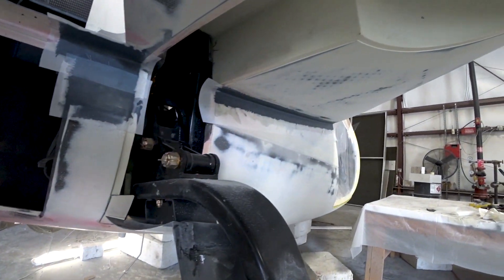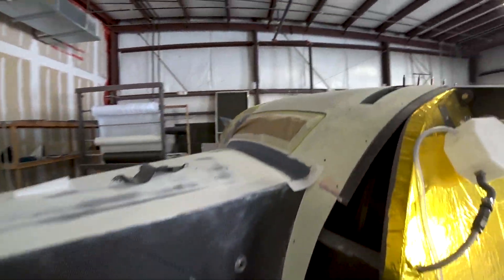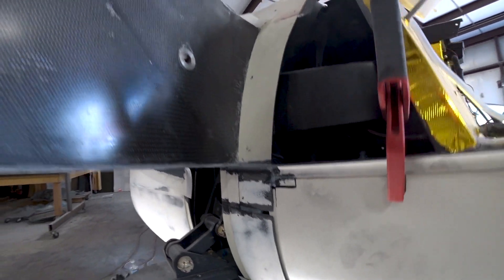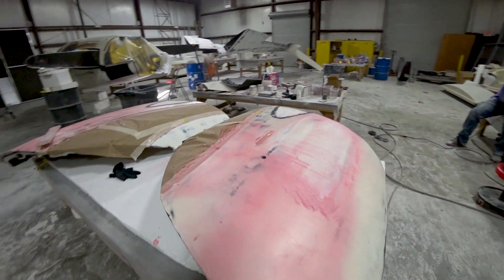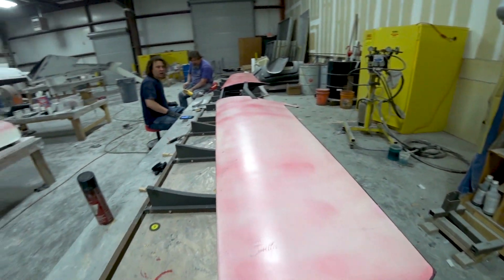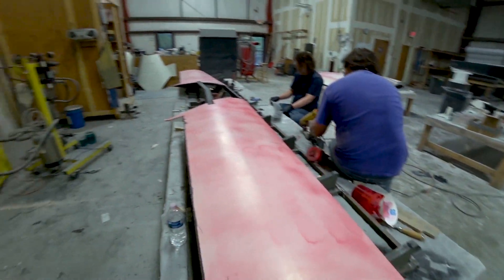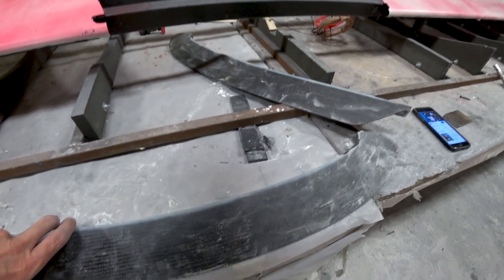Here are the results of my work — got the upper and lower done on that side, and the upper done over here, and the lower done there on the front, but I still have to do the last little bit at the back just in front of the baggage doors. Here's Jeff with the next set of guide coat on the doors ready for more sanding, and likewise we've got the foreplane with some guide coat on there — that's just going to get a quick sanding since those upper-surface skins really haven't had much done to them.